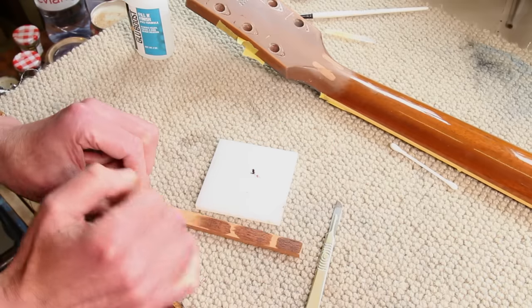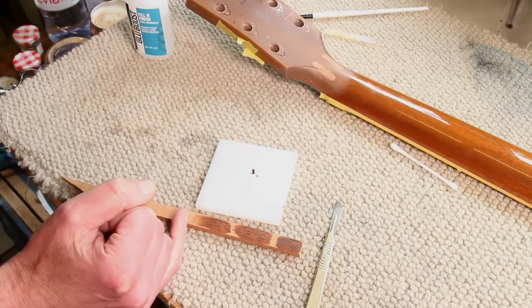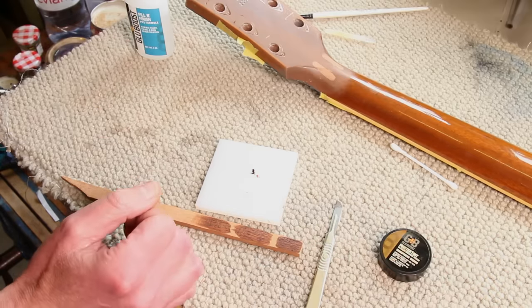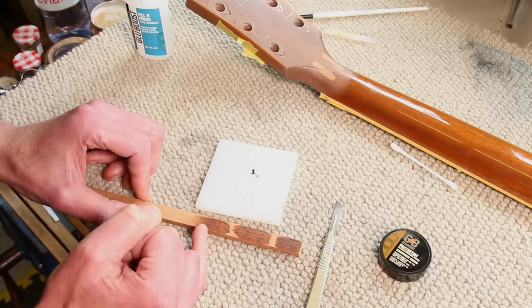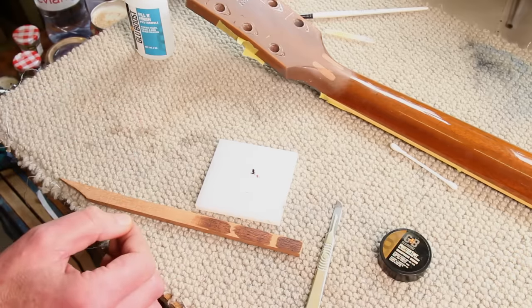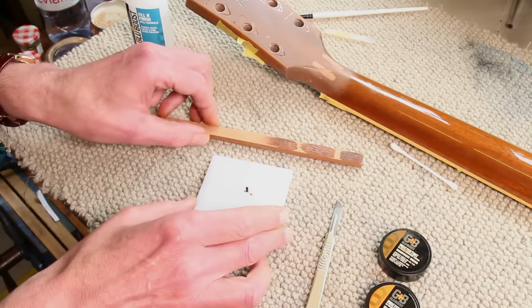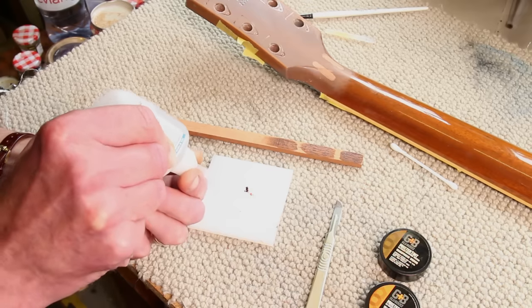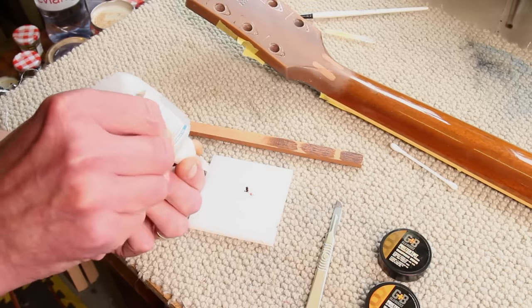So I've tried earlier on today a couple of colour matches and found that just adding the transparent brown, just using that alone, produces quite a dark colour, even as I thinned it down. So on this mix, I'm just going to try a tiny amount of the brown and an even smaller amount of the transparent amber, which I think may just help to give the right colour. I'd rather go at this stage for a too light colour rather than a too dark colour.